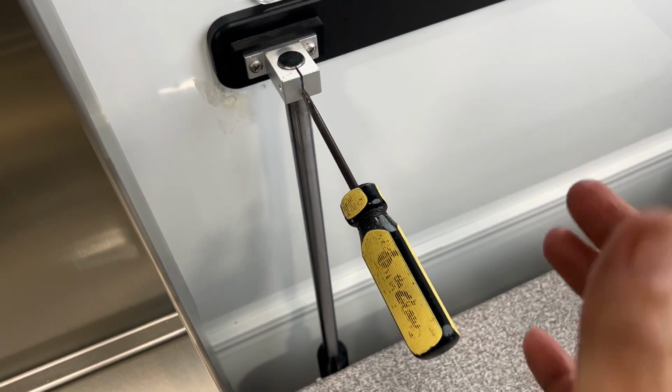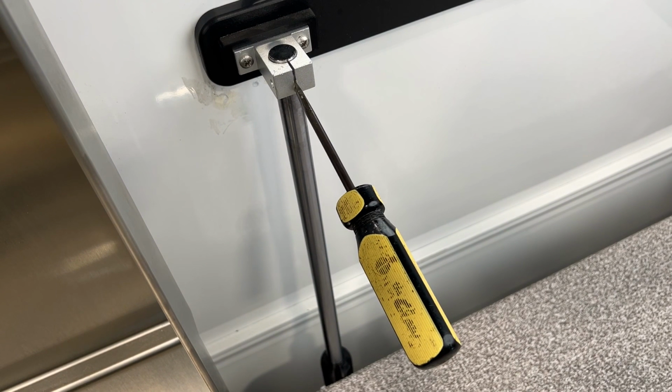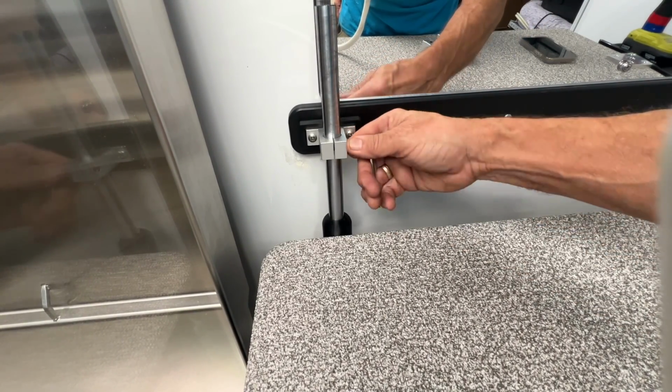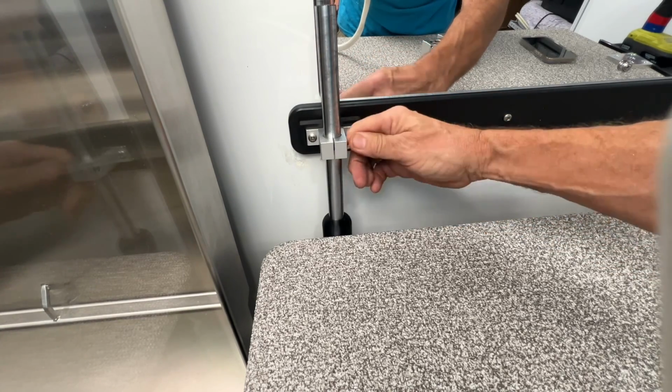If you find that the rail doesn't move well, then you may even want to push the screwdriver in a little bit further into that joint to give you a little more looseness. And remember, leave the screwdriver in this joint until you're through moving the rail. Now that you have successfully raised the rail to give you room to add the bearings, let's go ahead and tighten the set screw so the rail can't fall as you're putting the bearings on.